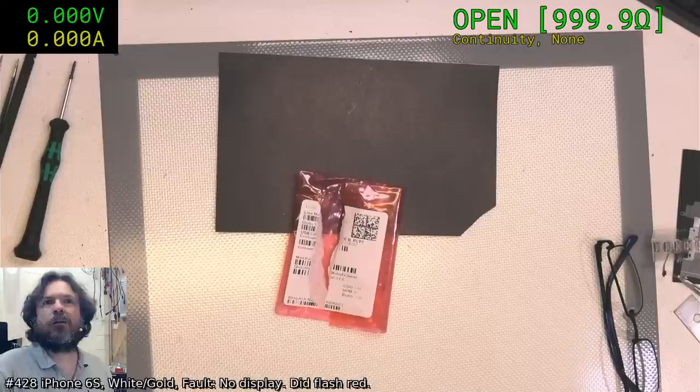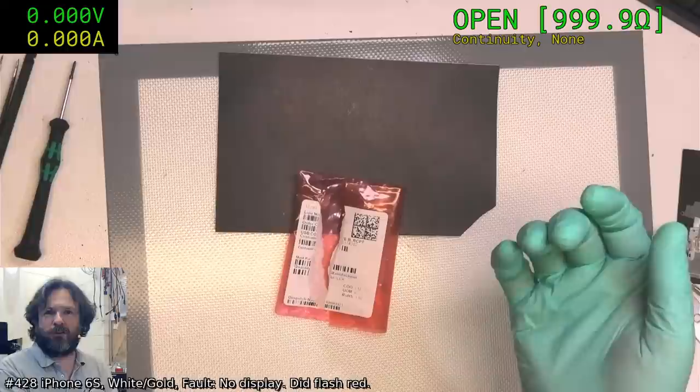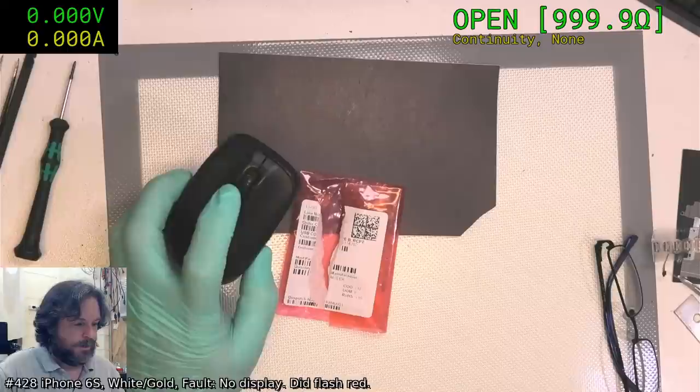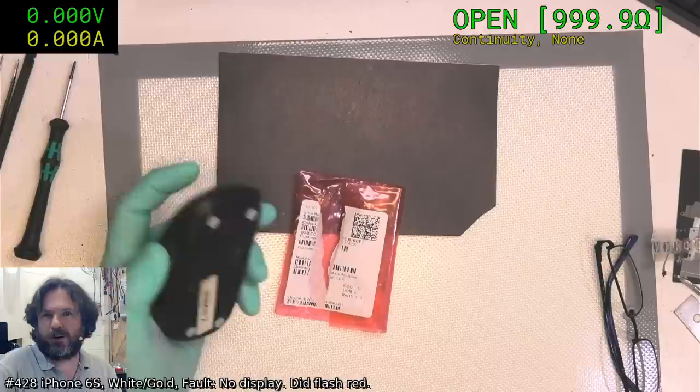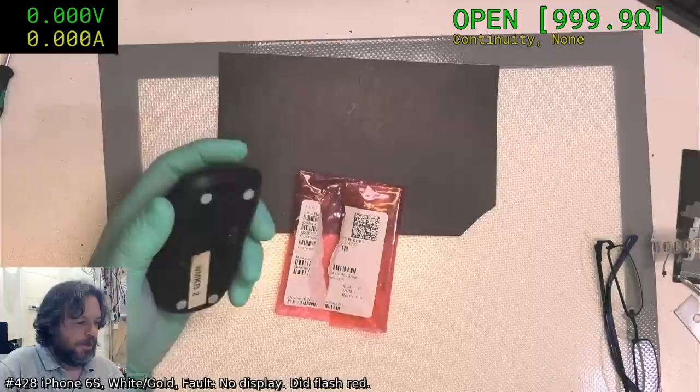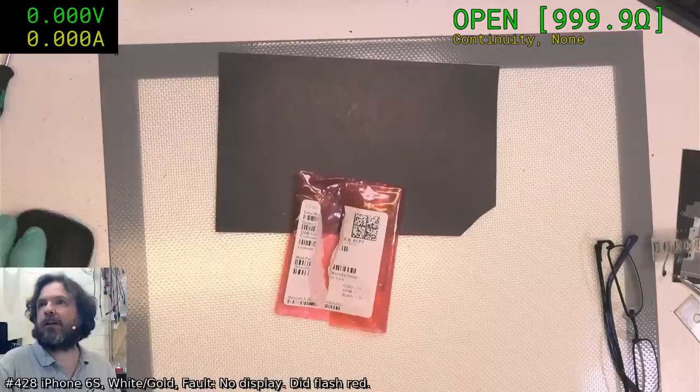Yeah, I know the rubber. With the Microsoft mouse, I know what you mean about it wearing out. I'm pretty happy with it. This is why I keep repairing these ones, even though they're only about 30 bucks. What I've also got coming is the middle button that always dies, because I'm a Unix user and the middle button is the same as paste. So instead of hitting Control V or going right click and then paste, we can just hit the middle button and it pastes. I found a high reliability, high use tactile button that I can use, so I'm ordering in a bunch of those.